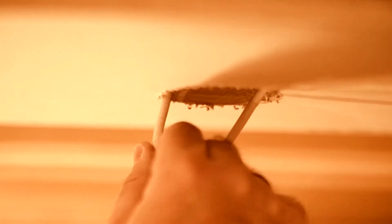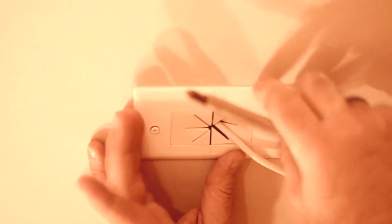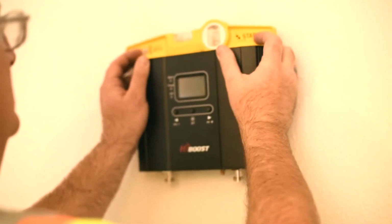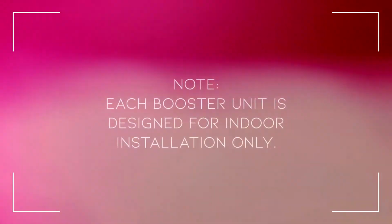If the coax cable is being routed through the walls, protect the connectors by wrapping a cloth rag around the connector ports and a few inches of the insulation with electrical tape. A split plate can be used as an alternative to the kit's black putty when covering any drill holes. Now, your SmartLink-enabled booster can be mounted with the provided bracket as well.